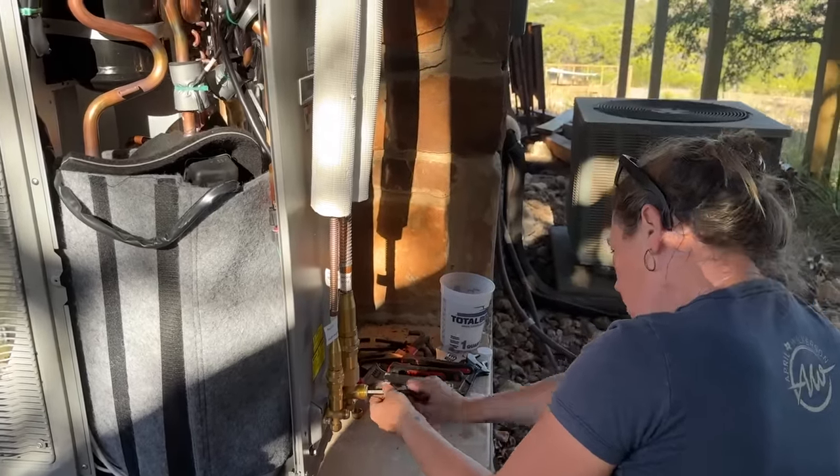After getting the new air handler in the position of the old one, I took photos before taking it apart so I could make the same connections. I made sure I wired in my float to the low voltage. Going down to the condensate line — an AC friend told me something interesting. I've had my attic flood before because the condensate line gets clogged and backs up, and then typically the bottom of the case floods and overflows into the pan. My previous float was on the pan but not wired in. My AC friend said throw in a second line that empties directly into the pan, so if the first condensate line backs up, the second line will just automatically start working.